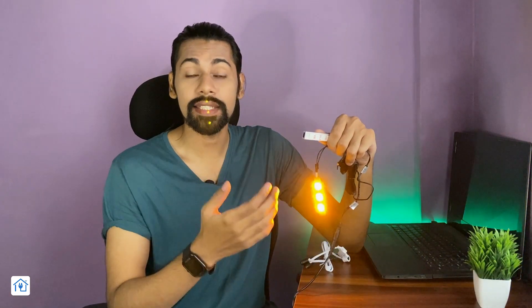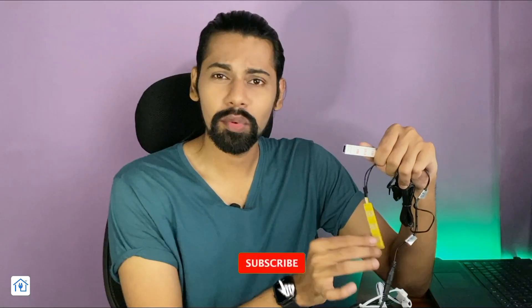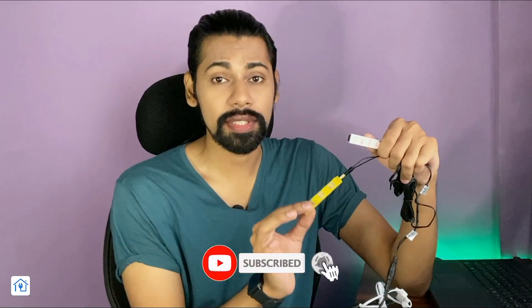If there are no doors, then how will the lights turn on? Simply, with your hands. With this sensor, you wave your hand and the lights will automatically turn on smoothly. And in the same fashion, with your hand, the lights will smoothly turn off. I have put a single LED strip here with 3 LEDs. You can put a complete LED strip — up to 60W. So if you use a 12V power supply and a 12V LED strip, you can use this sensor easily.